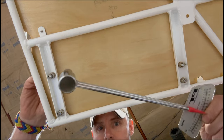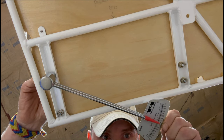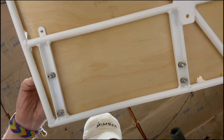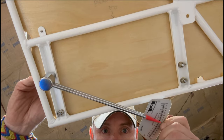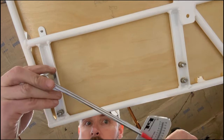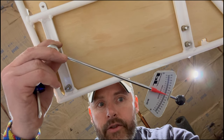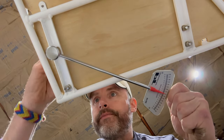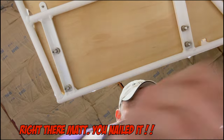Install the pedal assembly into the aircraft using the hardware shown, torque the nuts to 20 to 25 inch pounds - so that's what we're going to do. Co-pilot side of the aircraft, the farthest one aft, and it's going to be pretty challenging trying to torque when I can't see the scale myself. Looks like it's 10 and 20 - the first two parameters - which I should be able to see easily. If I can get on the nut, that would be very helpful. I'm going to have to play that video back for myself to make sure that's actually where I was.